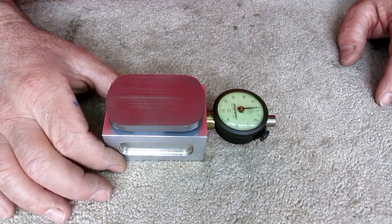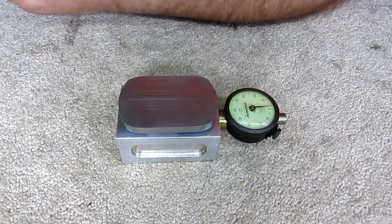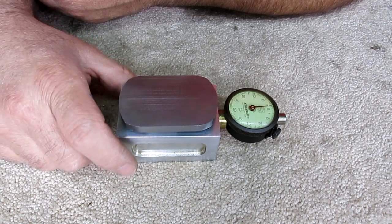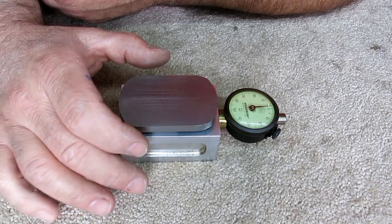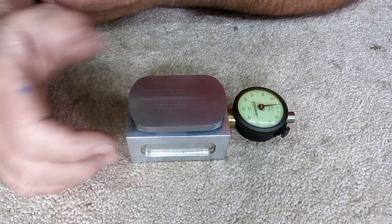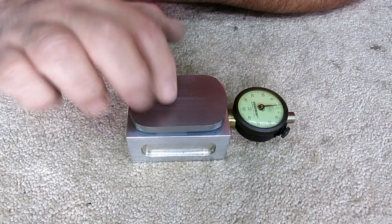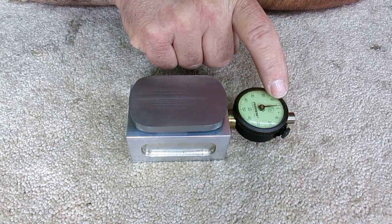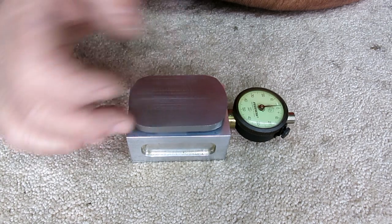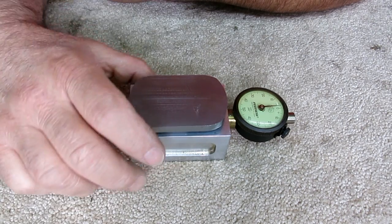And then here's the next thing that you guys have never seen. And you go, what the hell is that, right? So some of the CNC guys may figure out what this is here. This is for touching off your tools in a mill. And so the idea is that you bring your tool down and you touch this top table here, okay? And you get a displacement, okay? And then you know when your tool is a particular height off of the table, right? In this case, it's 2 inches, roughly 50 millimeters.